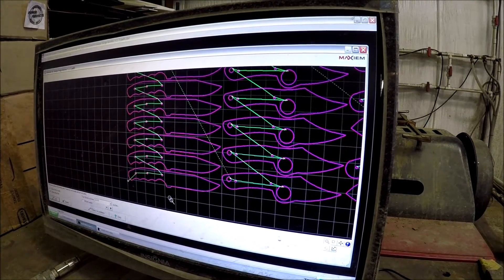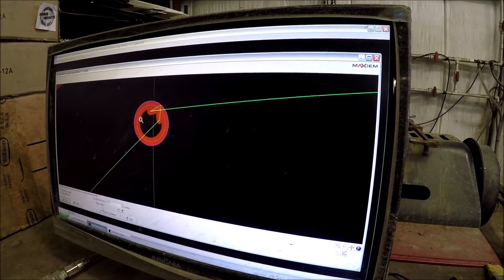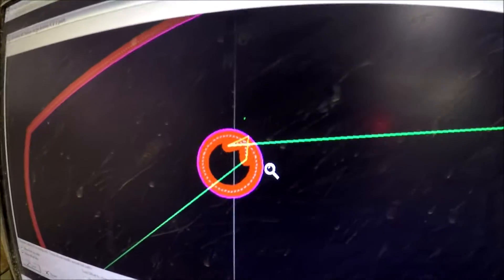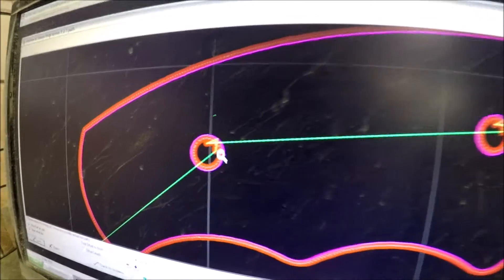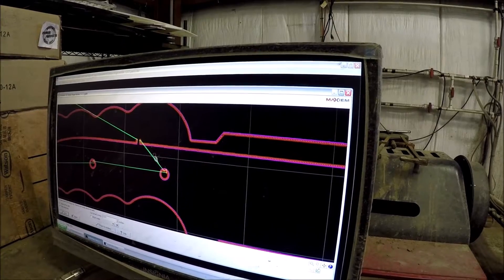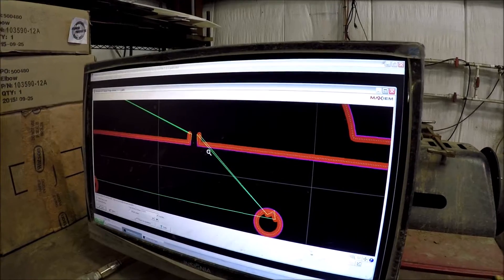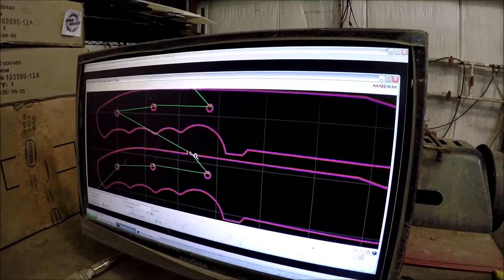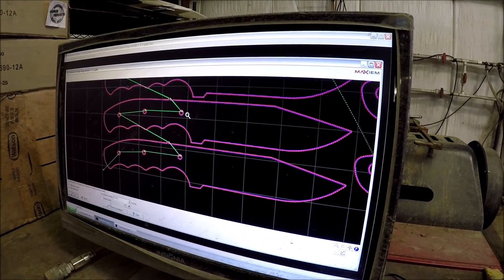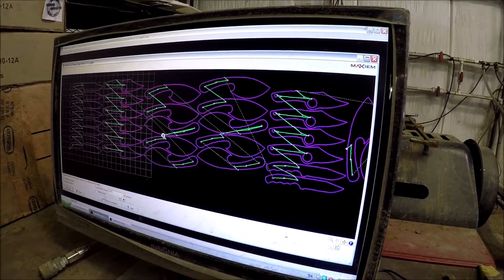This will show you what the machine will actually do when it's cutting. If you zoom in on a hole, you'll see the dashed center with a red offset — that's the actual path of the nozzle. You can see it doing its lead-in, cutting, traversing to the next hole, and finally going to the outer profile. I've left a tab so the piece doesn't just fall out into the bottom of the machine. It goes around the profile, finishes off to cut under the tab, then moves on to the next one.